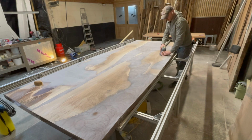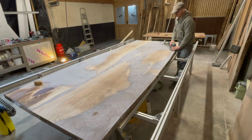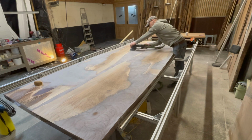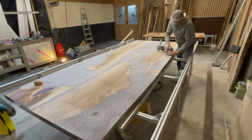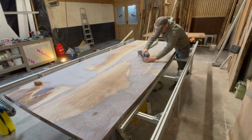As always with the sanding, there's no secret or magic here, it's just taking your time. I don't want to film me standing over a bit of wood, sanding it for hours on end, but I do sand it on and off for days, working through the grits. And as I always say, anything below and up to 120 grit, you really need to take your time to get those marks out. So stay on the 120s, keep throwing the paper away, it's not expensive, keep using fresh paper.